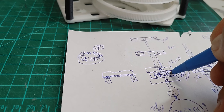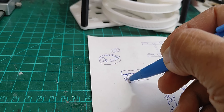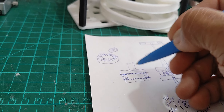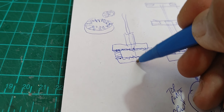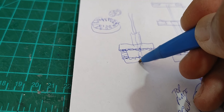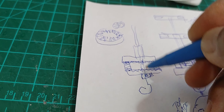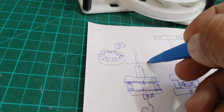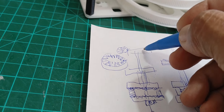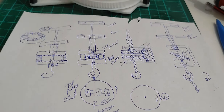Our way to do this, instead of using plates and rubber wheels, is to use two regular gears and two crown gears, one on top of the other. That's how you would establish the same thing I'm showing with the bevel gears. You have a shaft through a hollow shaft — the solid shaft is attached to the top crown gear, the hollow shaft goes right through and is attached to the lower crown gear with a set screw and a hook. As this spins, it transfers power counterclockwise to the top gear. Because one is attached to the lower rotor and the other to the top rotor, you get counter-rotating rotation.